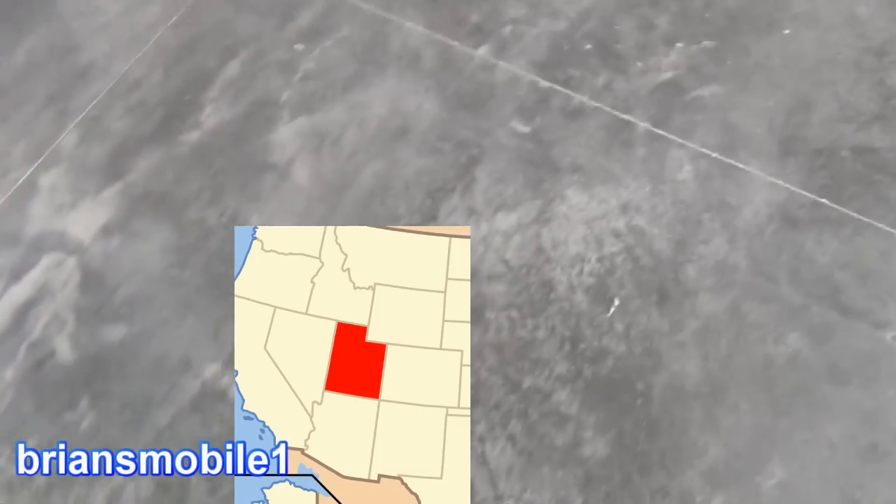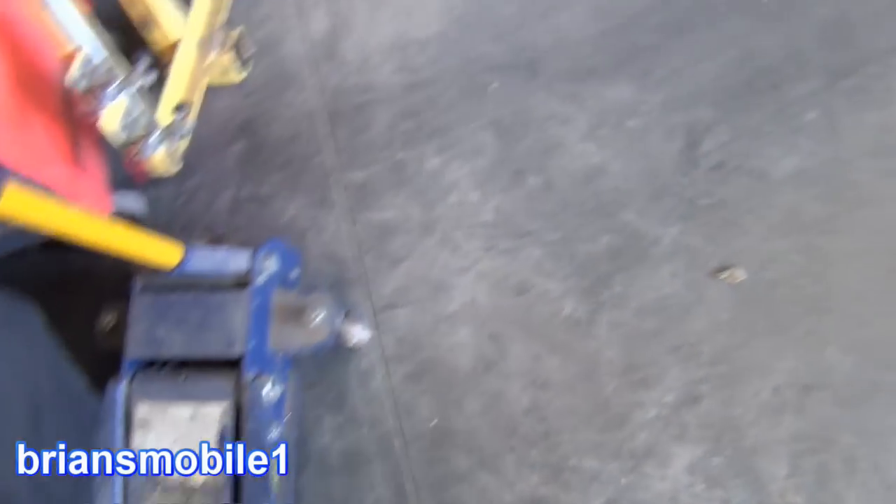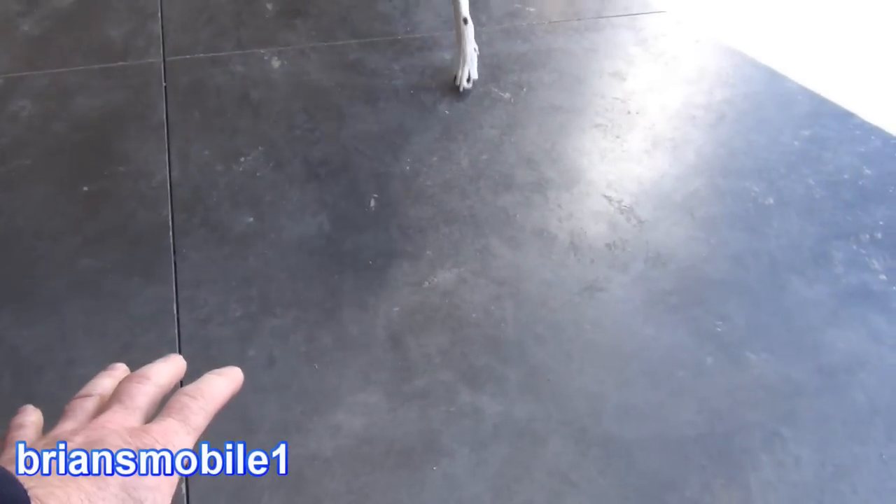There's a pattern in the floor and you don't see any cracking outside of the relief cuts that have been put in. You can see the shape all the way around but there's no cracking. The cold joint area has a kind of funky texture — we weren't able to get it very smooth; it's coarse, so if you spill oil there it won't wipe up very well. But the rest of the burnishing turned out really nice with a good shine. Concrete is an exothermic reaction — it puts off heat as it dries, and this one continued to put off heat for a longer period.